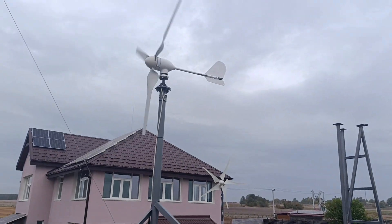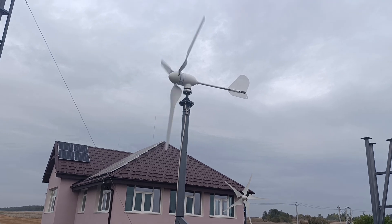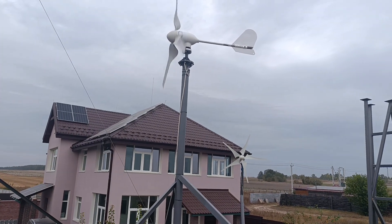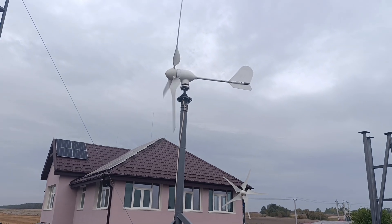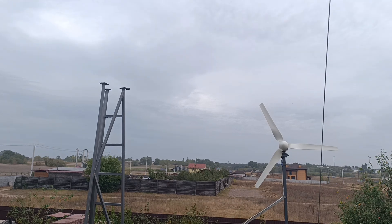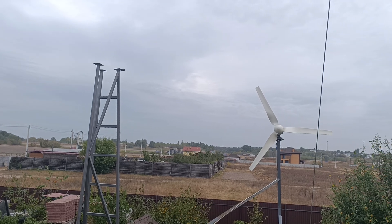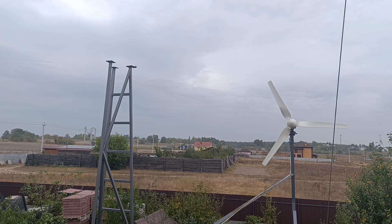Remember when I was measuring the iron thickness in the generator — the rotor and stator — to get the overall value? The diameter is absolutely the same; they are interchangeable. But the difference is that here I measured 24 millimeters and here it is 26. I don't believe two millimeters alone are causing this kind of massive difference.